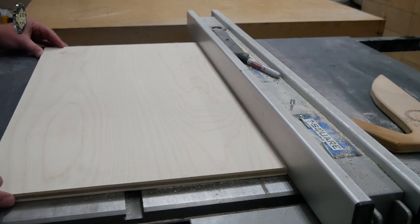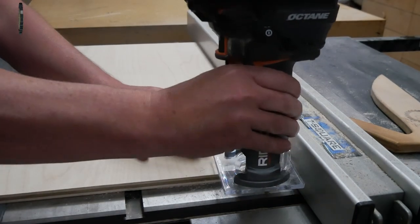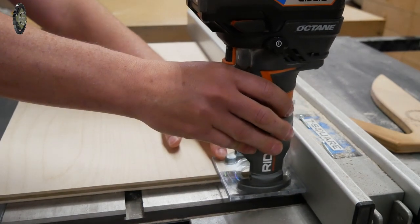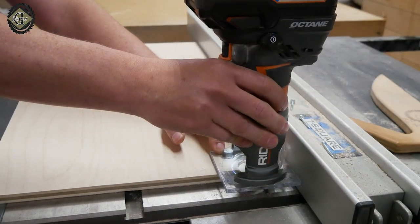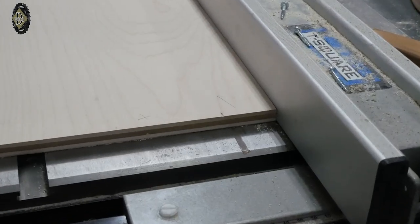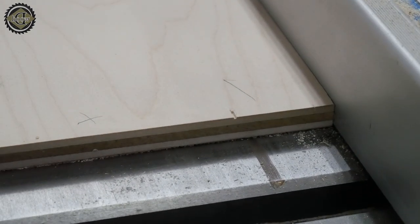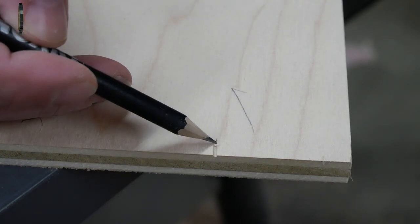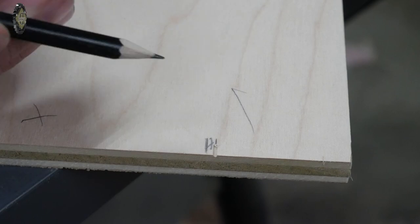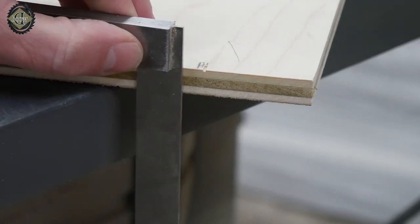The first thing you want to do is put this piece of plywood up against a known straight edge — I use my table saw fence — and use that v-bit barely sticking out to make a little mark in the wood to get the center point of your dado. Now I'm just marking the very center of that line and to the inside of that, because this is where you want the blade to actually cut away.